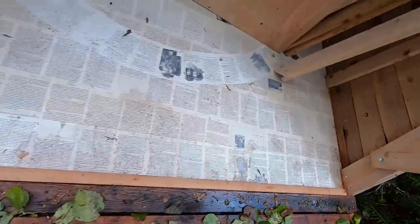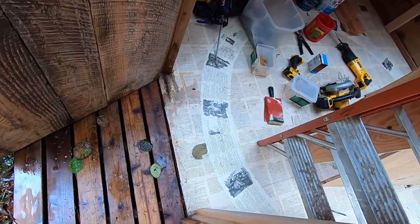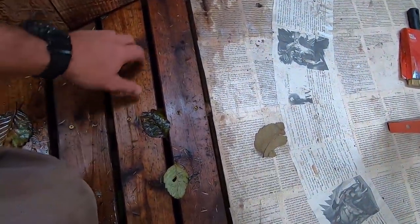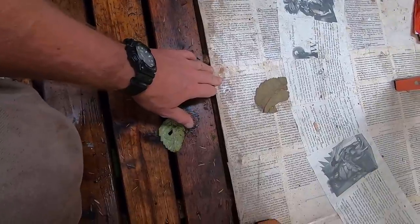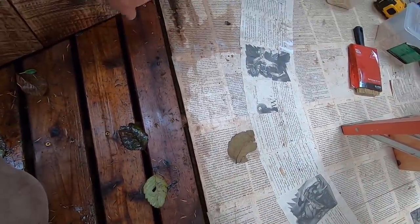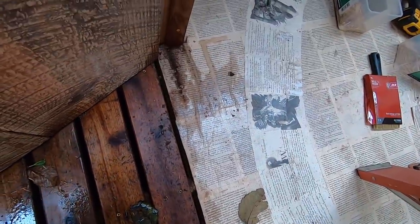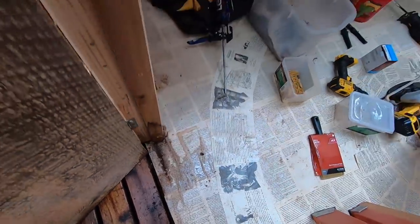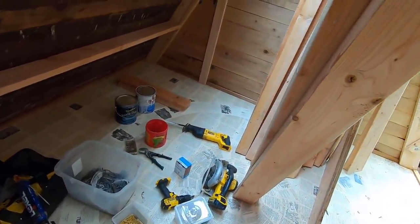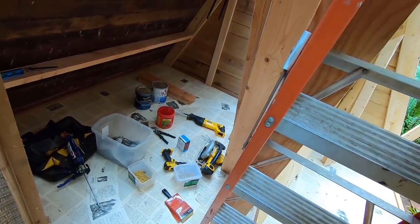Also, even worse, the front door. I hoped that my awning would shield the door from getting very wet, but you know, the bottom of the door out there on the outside is definitely having rain hit it, and you can see that it's making its way under here and onto the floor. So that ain't good either. I think I can put a piece of weather stripping here and caulk that in, hopefully resolve that problem, and I'll address the front also. Otherwise, it mostly looks pretty good in there as far as water. Maybe I can see a little bit on that back wall. I'll have to get over there and take a closer look. So a few things need to happen here to tighten this up.